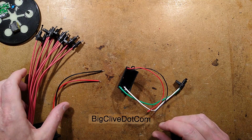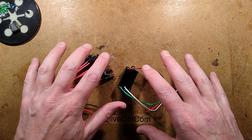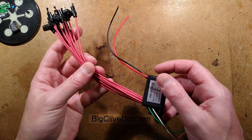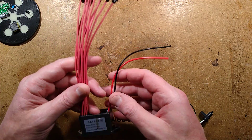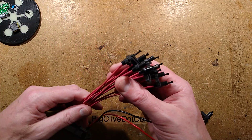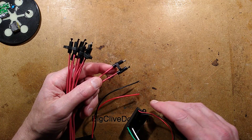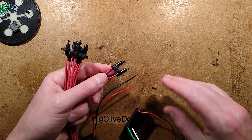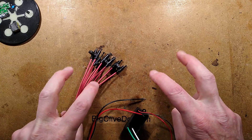The high voltage module explorations are continuing. My apologies if you're getting ozone fatigue and ionizer fatigue, but here is a common enough cheap Chinese module. You stick in 220 volts and this one has loads and loads of emitters, sort of as pairs. You sometimes see this if you open things like air conditioners or room fan units — you'll find one of these little modules poking through in the duct, and that's the ionizer function.